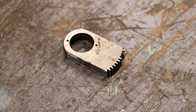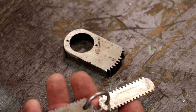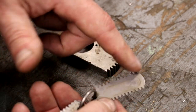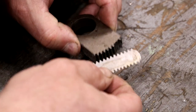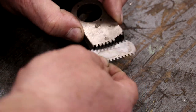To determine the pitch I used a set of pitch gauges made by Boston Gear. These have a rack gear for all the different pitches and are stamped to show what pitch they are. You just go through them and figure it out — this one happens to be a 24 pitch.